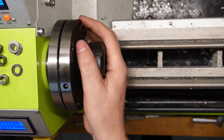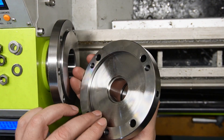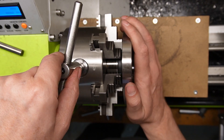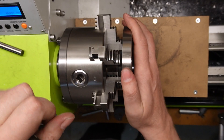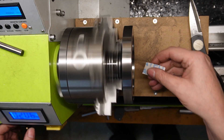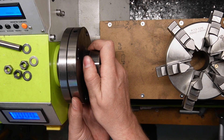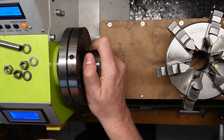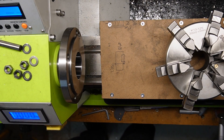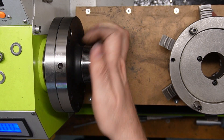The ER40 is a very different story — it is far from fitting the spindle. That chuck is going to take a lot of work; it almost needs machining. But I will take it with sandpaper. I am clamping on the threads and I don't like it. The first test shows there is a long way to go, so I will keep taking a little bit at a time — you don't want to take too much. It really is a matter of testing and testing and testing.